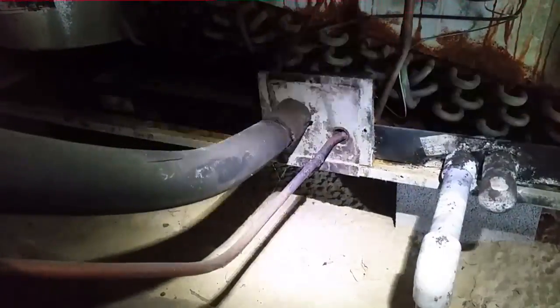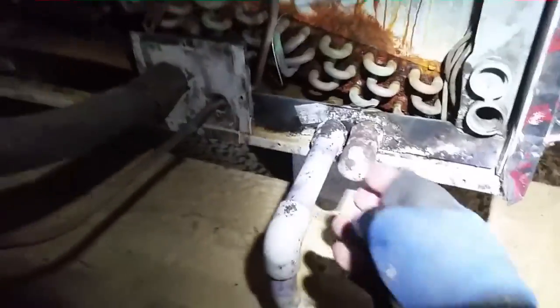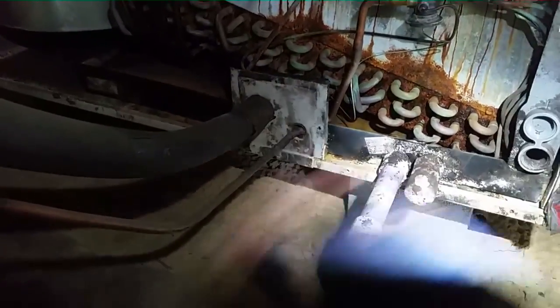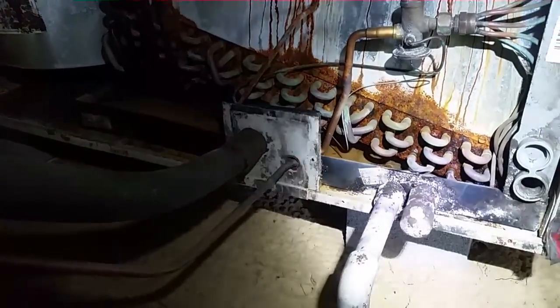Recovery is all finished so I'm going to cut these lines off right here — there's plenty of play in them because they run off to the side and run down. Luckily there's plenty of play so I'll cut it off here. I'll take the drain fitting out or just leave it. I'm pretty sure we had to reuse the old coil panel on the bottom. We'll pull everything out, put the new micro channel one in, and get ready to fit everything back up.